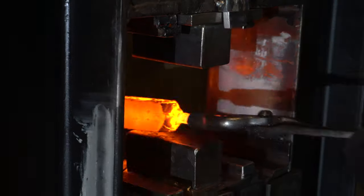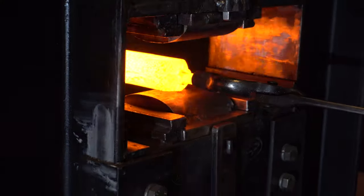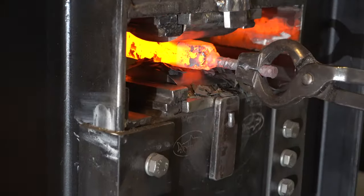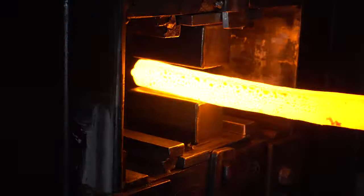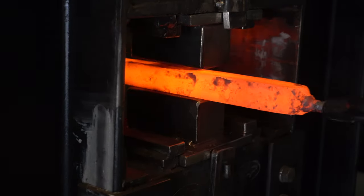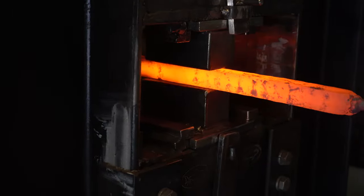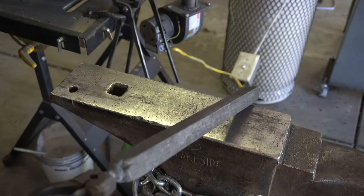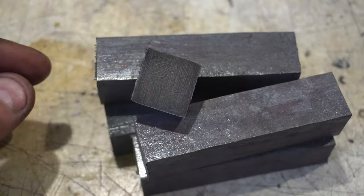Like in the last forging, I want to forge this out into a long square bar because I'm going to slice this up and do the same thing — cut it into four and rotate it. As you can imagine, forge welding this by hand with a hammer is virtually impossible with so much to do; you really need a forge press for mosaics. I want to make sure this is as straight as possible with as sharp corners as possible, since I'm going to be forge welding this back again into a square. I'm pretty happy with the pattern here.